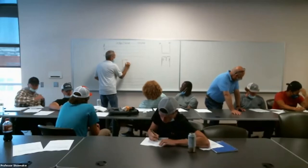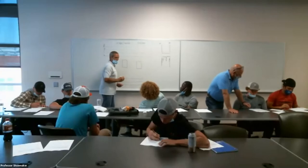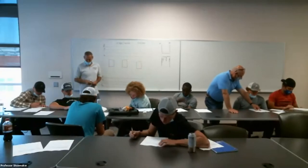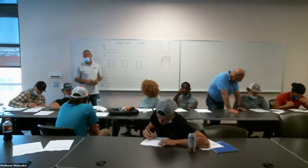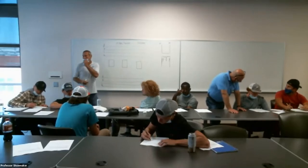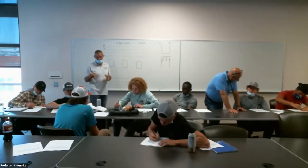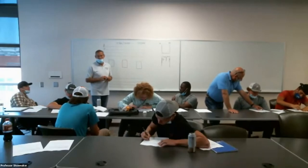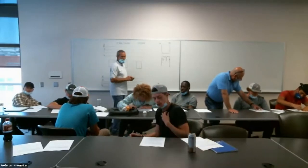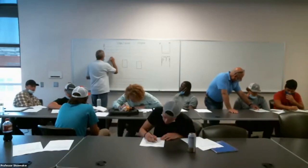The top line, read it all the way through to the end. Every sheet has it. What's the last sentence? Does the transformer secondary Y bank change? No. Only the Y bank. Make sure that when you do this, for real, when we have a quiz on it, you write that in. So on the Y bank, you change it to AC. Correct. Y bank. I'm going to draw my bushings in.